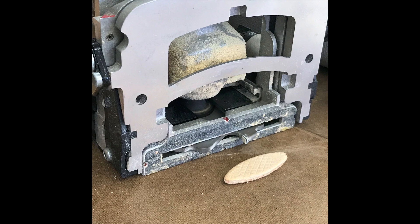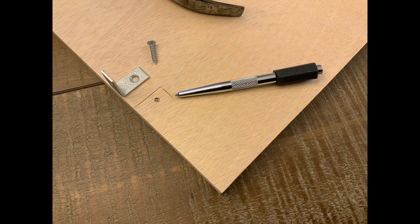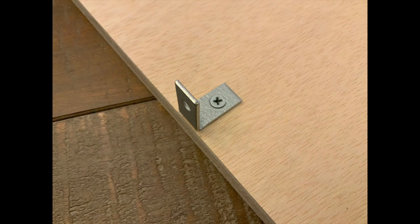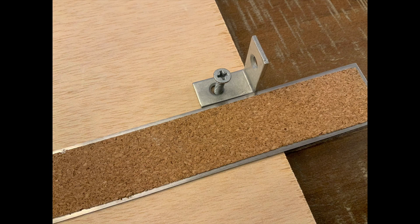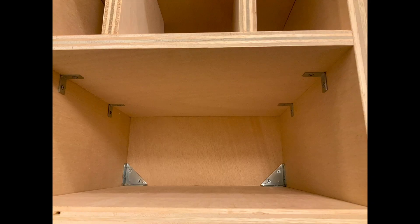This is the biscuit cutter I showed you. Now, to secure the shelf, I got L-brackets. I made a small drawing and used a center punch to make a depression, so it's very easy then to drive a screw in there. Then with a ruler and a 90 degree edge, I transferred this over to the other side. Center punch, put a screw in, drill it, and then there you are.